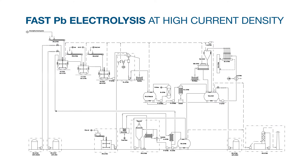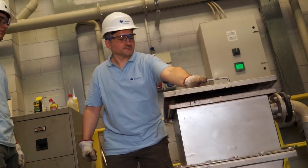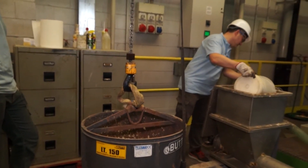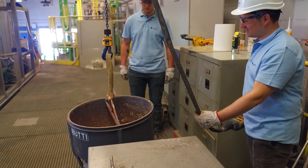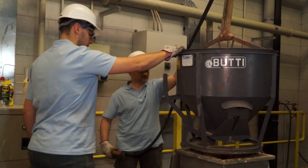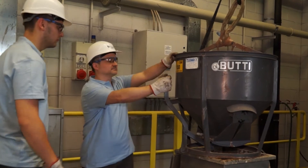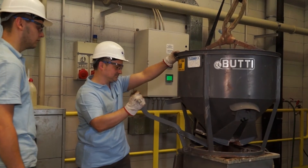The first step of the process is feeding the paste into the leach reactor. A feed hopper, receiving hopper and screw conveyor transfer the paste and leaching reagents into the system. The feed material and additives are carefully weighed and measured before addition to the circuit. All equipment is enclosed and ventilated for protection of the worker and the environment. Lead and greenhouse gas emissions are virtually eliminated with this process. This feeding system ensures an even, well-controlled and easily monitored addition of material.